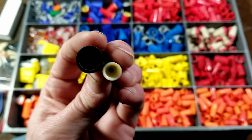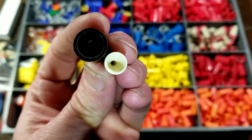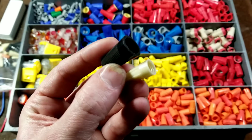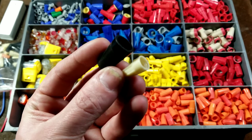There are some very cheap wire nuts, such as this white one here, which actually doesn't have any metal insert — it's all plastic. I recommend against them. They're really cheap, but not having a metal insert means they don't last as long under thermal cycles. They want to get loose much more easily, and I generally don't recommend them.